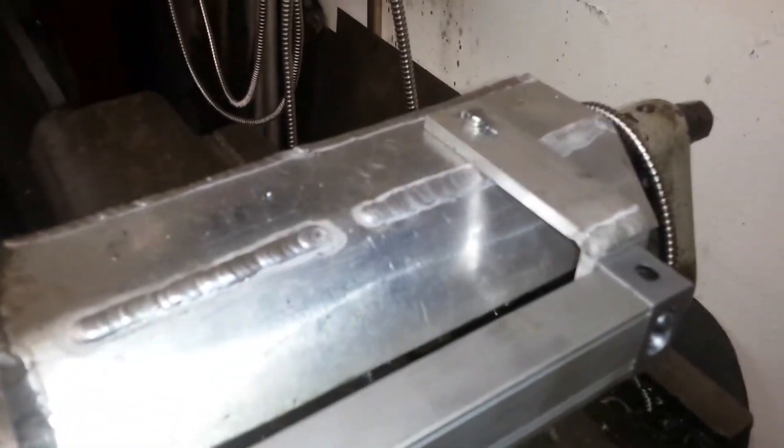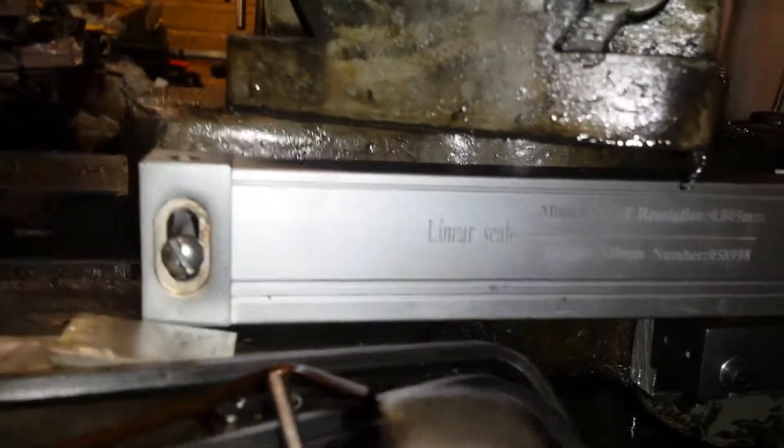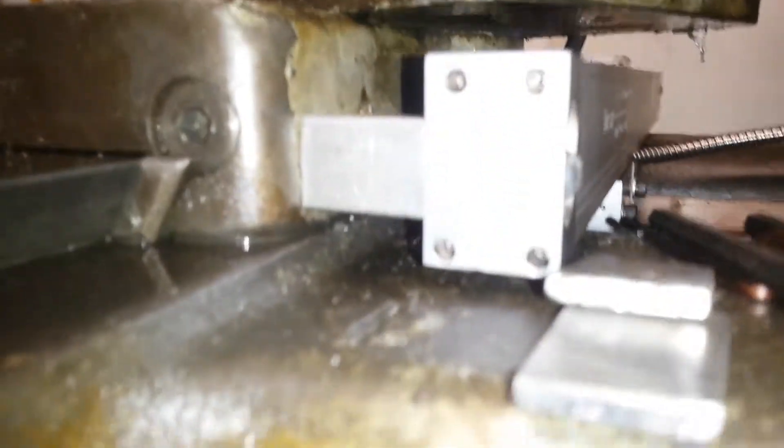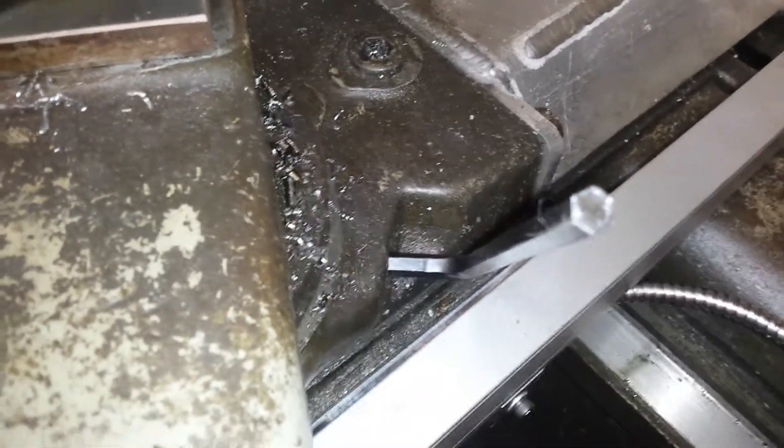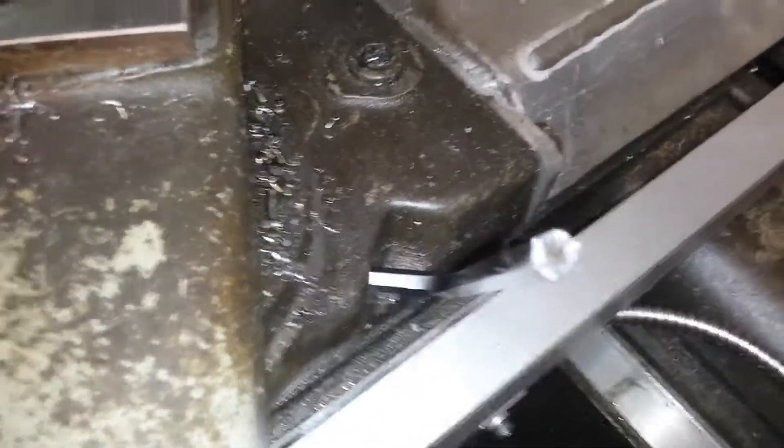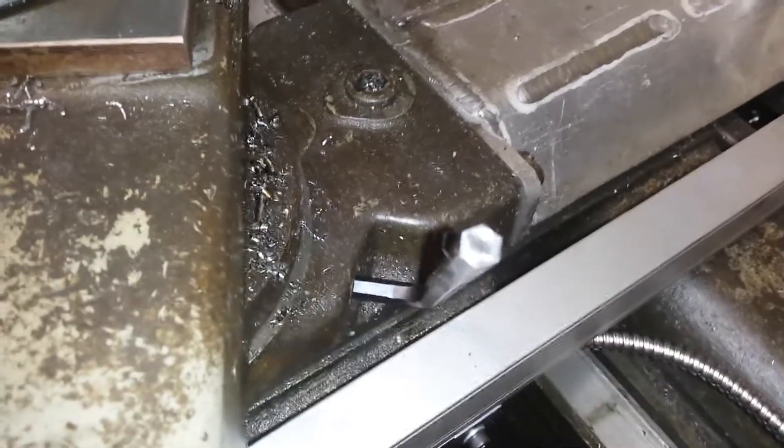This is how I mounted the scale on the cross slide. The aluminum cover I made here keeps the junk off the lead screw, and that bracket I made up — this is how it mounts. One of the things to consider when you put these on is obviously being able to have access to the machine to use it. Part of the reason it's spaced back like it is, is so that you have access to the set screw so you can turn your compound. If you put it up close, it would obviously be in the way. I didn't want to put it on the chuck side, because chances of it getting smashed by something in the chuck is pretty good. So this worked out pretty well.